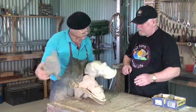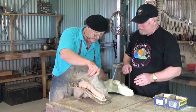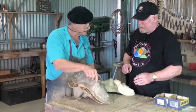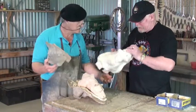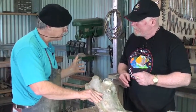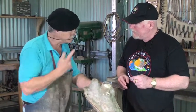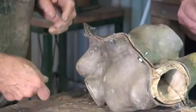You take the fiberglass jacket off, peel the clay off, and put the fiberglass jacket back on, and now there's a hole where the clay was. You fill that with rubber, and you get that. You do it to both sides. This is just silicon rubber. You bolt it all together, and then, as I'll show you, we pour wax in there. Pour it out, and you get a thin film of wax inside. That's what you found. Wow, that sounds great. Well, let's bolt this up then.